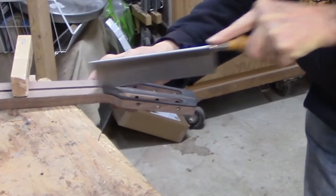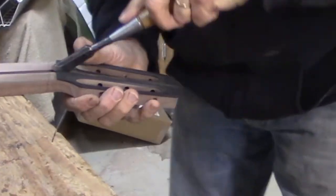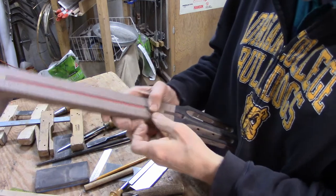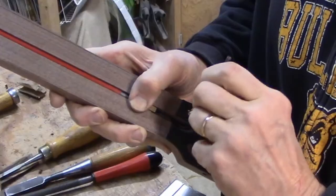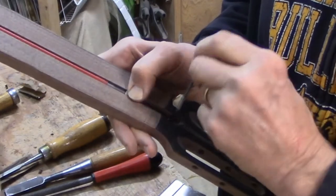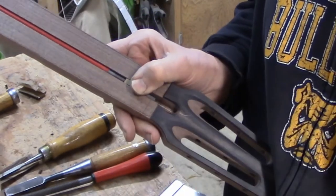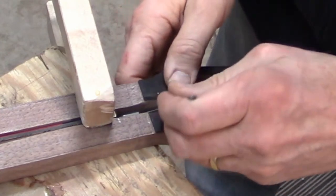There's not a lot of space here for the adjustment with an allen wrench, but there's enough. I'll check if I've carved away enough so the truss rod sits here and the allen wrench reaches. I want to take just a little bit more off right here so the allen wrench can swing a little bit farther. I'll try this one more time with the truss rod clamped in place so it won't give me any trouble.